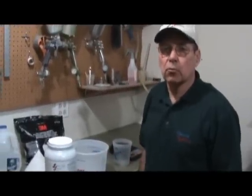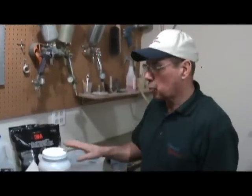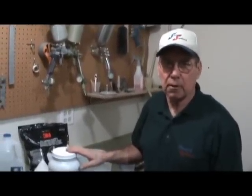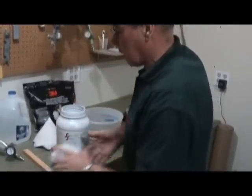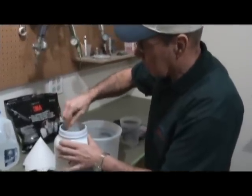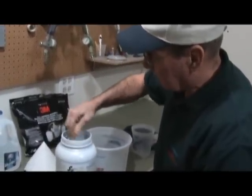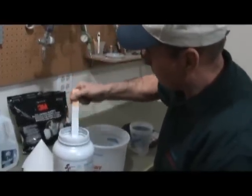We're ready to start mixing the paint. On this wing we're going to mix 50 ounces of primer and 5 ounces of distilled water — that's a 10 to 1 ratio. You need to give it a little bit of distilled water to make sure it goes on nice and smooth. When you first start spraying, if the primer doesn't go on as smooth as you think it should, it's time to either change the viscosity of the primer or change the air pressure of your gun. This primer should go on very smooth so it's easy to sand once it's put on. You always want to stir your paint prior to pouring it out of the container — you need to be sure that anything settled to the bottom is in nice suspension.